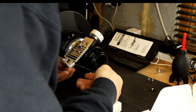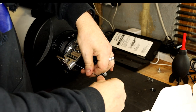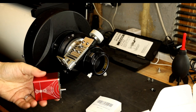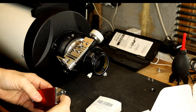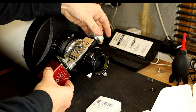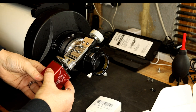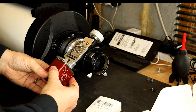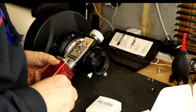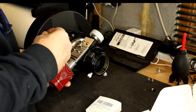and then we'll pinch that onto the spindle. On your focuser, the spindle here normally has a flat side. You want that in line with one of the grub screws that you've got pointing down. And we're going to place that in and we'll make sure it goes in enough for the grub screws to be able to locate on the spindle and that you're flush up against the bracket. That looks good. So I'm actually going to just nip these up and hold it in place.